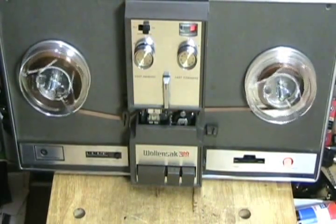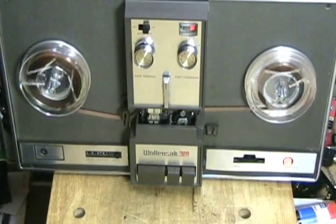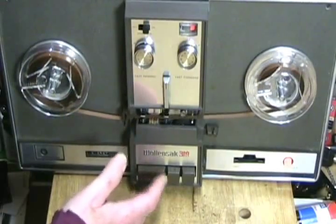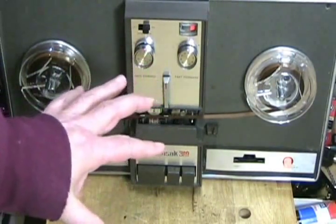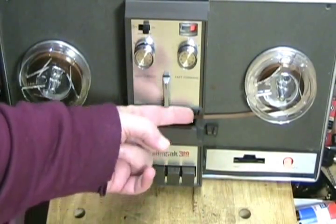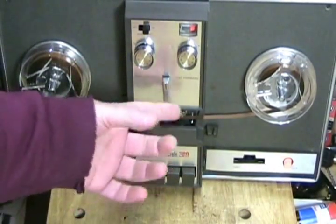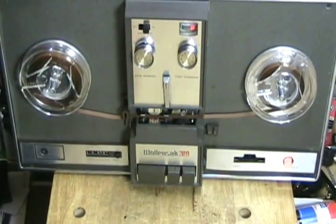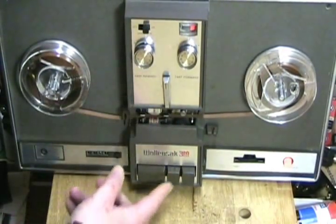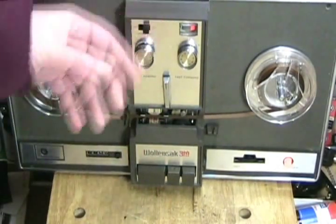The tape plays: 'Activities are starting off with an open house or back to school night, this evening from 7 to 9:30 at the Junction City Senior High School. All school patrons are invited.' Now when you turn it off you'll hear a little bit of a blurp, and the reason is because when you push the stop button this mechanism comes forward and then goes down — that is the way this thing was designed, so it always makes that noise when you push it in to stop. Did you see it go up? So at times you'll hear a blip when it stops.